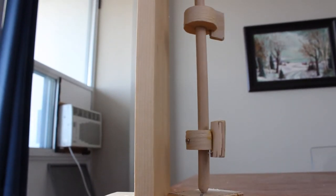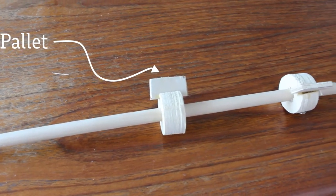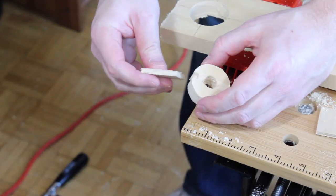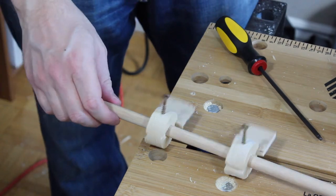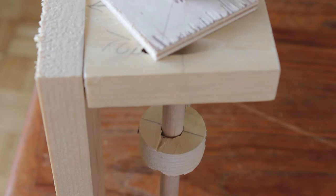Getting back to finding an alternative to jamming our fingers into moving machinery — how are we going to get that crown wheel to start and stop alternately? The solution is the verge. This is a verge: it's a shaft with two paddles attached to it, known as pallets. These are just collets with a little groove cut inside them that the quarter-inch board sits in, attached to the shaft using a small screw. I mount the shaft of the verge in its own stand, with the bottom sharpened to sit in a small hole in the bottom plate and the top passing through a half-inch hole in the top plate — so I can adjust those plates to get the shaft completely vertical.